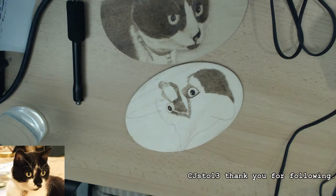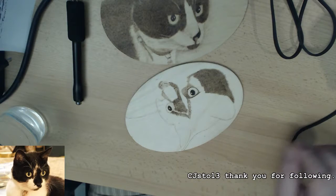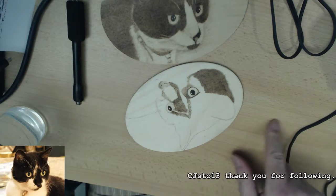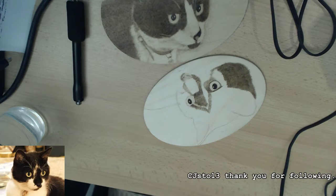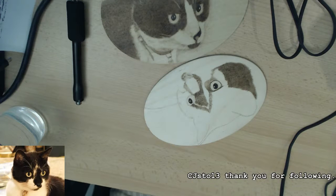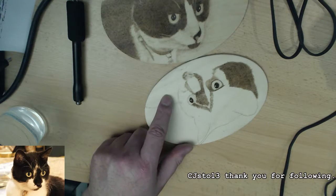You've only tried pine. Yeah, pine is very common, isn't it? It's very easy to do, but you've probably already found that if you look at the grain, the whiter wood between the rings burns a lot more easily and disappears from the edge of the tool. It shrinks away more than the ring bit, which can be challenging to work with because they take colour differently. If you try getting hold of something like, well, this is birch plywood, but for practice purposes any sort of plywood will do. Obviously for finished pieces you want reasonably good grade plywood, but for practice pieces any sort of plywood is relatively cheap, and it's not too bad, especially birch plywood, because there isn't a lot of heavy grain in it, and the way in which the grain and the rings take colour is about the same.